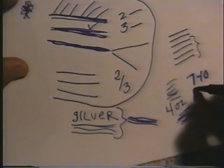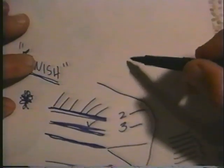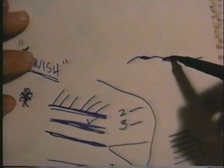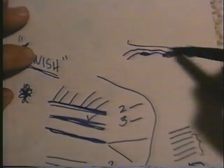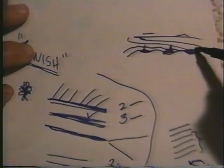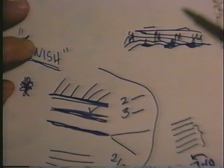This is a good place to save weight, in the 7 to 10 ounce range, in not putting on the last coat of clear, in doing the sanding early on. What happens when you have rough wood, just to exaggerate, is you tend to fill this all in with filler. The finish winds up weighing 10, 12, I think in Lampione's case he probably went even higher. And then after the clear and everything's on here, you start sanding it down. Well, the first thing that happens is you start going through in spots, but you still have all this extra paint and filler on here. And it's not necessary. It's really not necessary.